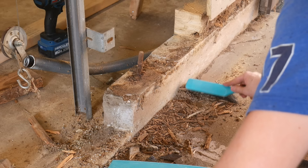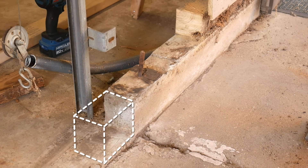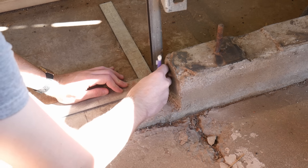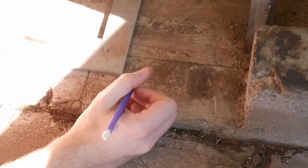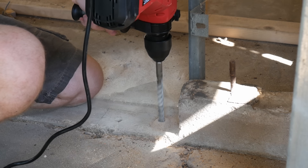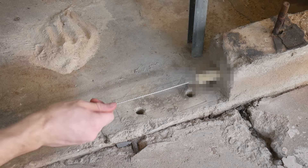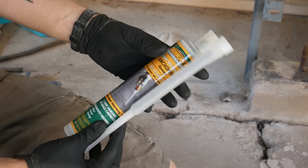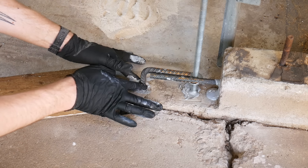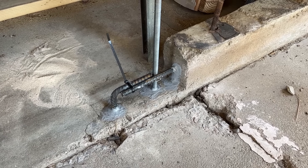Before I go and tear down the entire wall, I first need to extend the concrete stem wall eight inches on both sides of the building. Because if I want the new opening to be exactly 16 feet wide, I have to make up the difference from the space originally occupied by the stem wall that was between the original doors. After marking out where the extension is going to be, drilling some very large holes, and doing what I'm only allowed to show over on my Patreon, I used some industrial grade epoxy designed specifically to anchor things into concrete to anchor some things into concrete. This new anchor bolt and rebar will not only act as a structural skeleton for the new section of the stem wall, but they'll also mechanically lock it to the existing foundation.